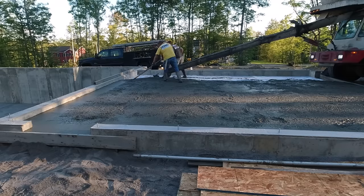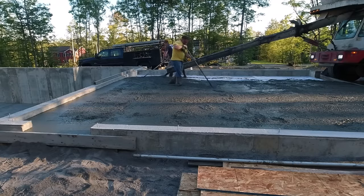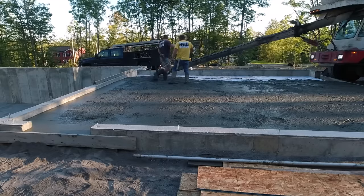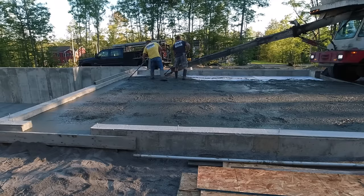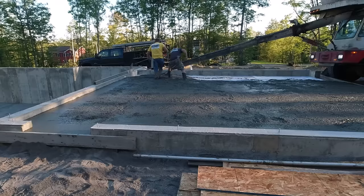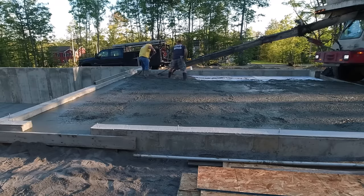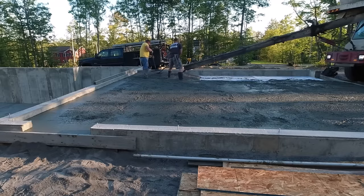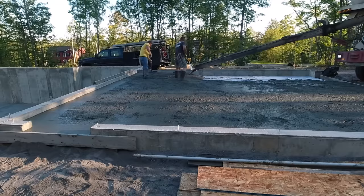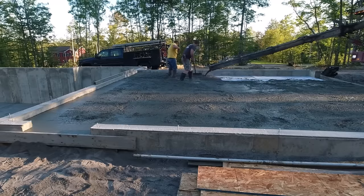Most just have the slope on new pours like this — sometimes we'll have a center drain, but not very often. Another thing we like to do is get almost all the concrete poured out in a garage like this, because the way we screed is different than most people and we're pretty fast at it. We know it's not going to take us very long to screed. What actually takes the longest is just getting it poured out of the truck, and then bull floating afterwards takes longer than screeding too.